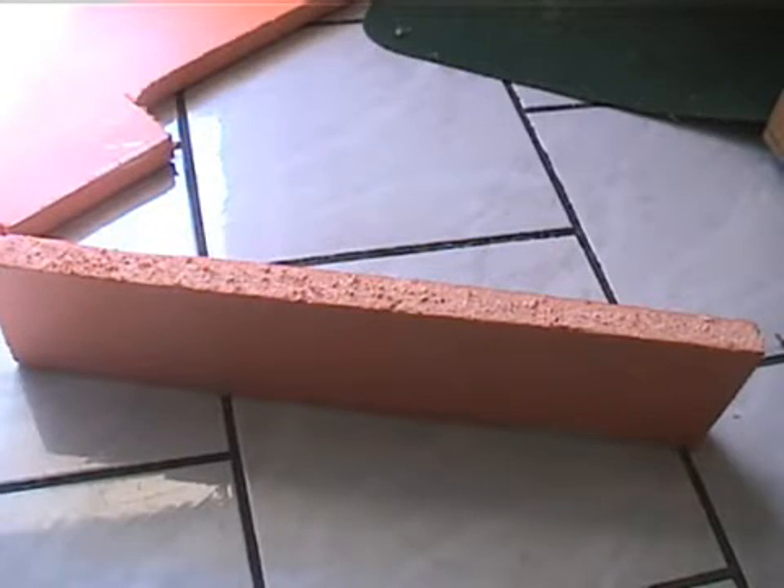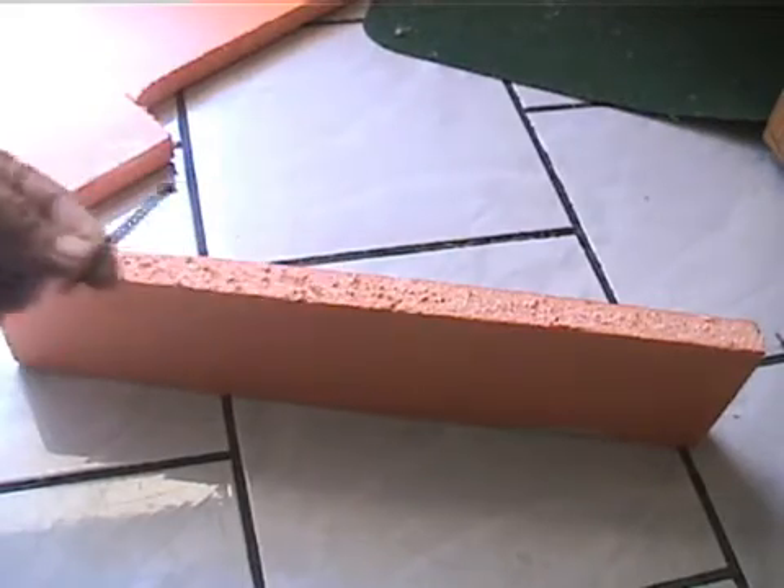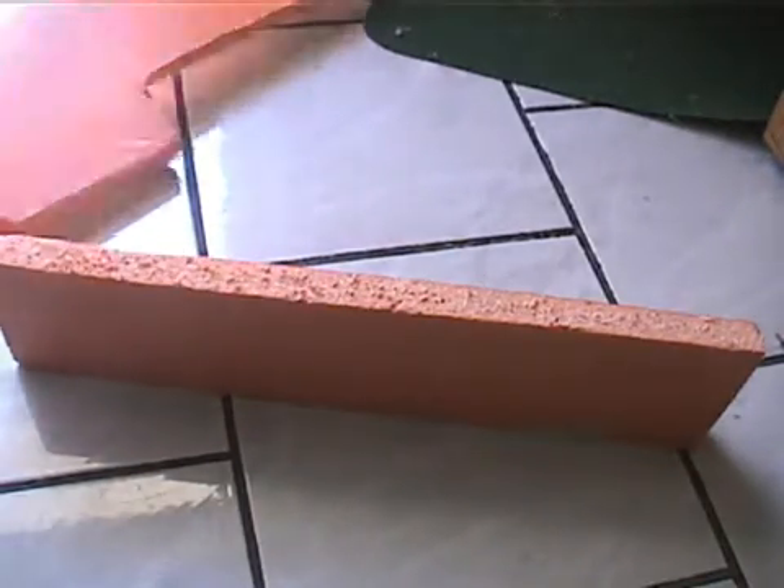This material is self supporting and can be put together with screws as you would do with wood. It is not as hard as wood but holds together quite well. Do not use an electric screwdriver. To put two pieces together it is practical to use drywall type screws with a length of two and a half times the thickness of the polystyrene so they will hold better.